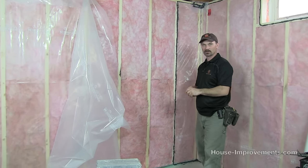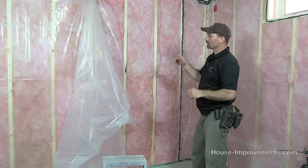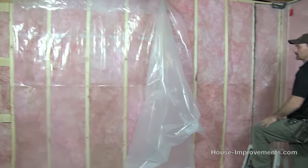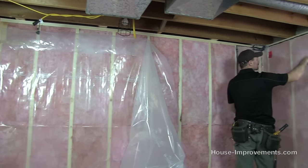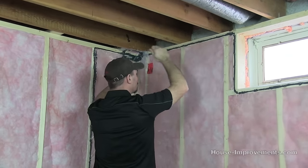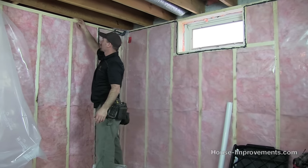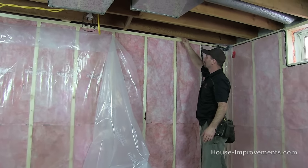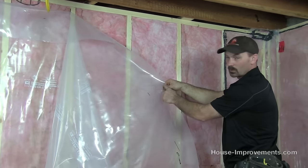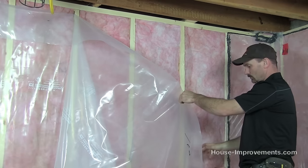The fewer joints the better, because there's less sealing to do and less chance of not getting sealed. Normally on this wall I just brought it up and used this top plate as a guide to get my length right so I'm straight, then I stapled it and let it drape down. Here we're actually sealing around the corner, so I pre-marked the poly at the distance I wanted so I can use those marks as a reference to get everything straight and not run short on the poly.